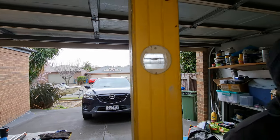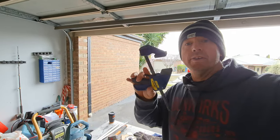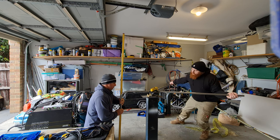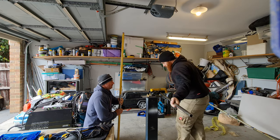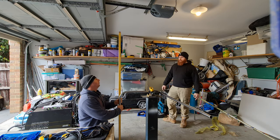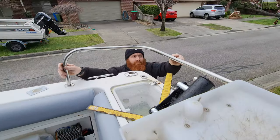I'll give it to some sort of monkey idiot just to hold that level — obviously referring to me. So if you didn't have a sidekick you'd use a clamp of sorts. If you're on your own, use something like this just to clamp it on there, hold it nice and level. Then I push on this bar so it doesn't kink, and pull at the same time — it takes a bit of force. I'll check that for 90 degrees. Look at that — nice and level.